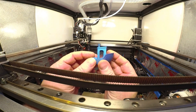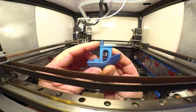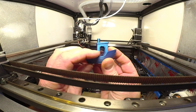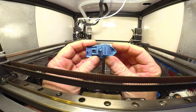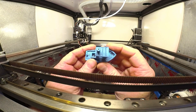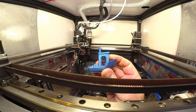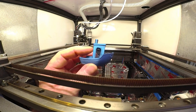Here's the benchy. The stack is at 80mm/s and it's very clean, so I think I should try 110 or 120 and see if the stack still has the same consistency. The columns are square looking, there's no melting in here. This little overhang here is not a big deal, but the cooling is pretty good. The top is pretty clean. There is stringing - retraction is about 0.4mm at around 60mm/s. The key thing I'm looking for is not so much that it was nine minutes, but I'm looking at the bow on the stack.